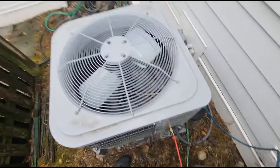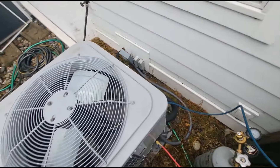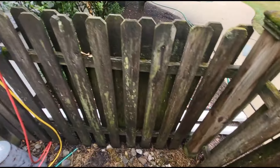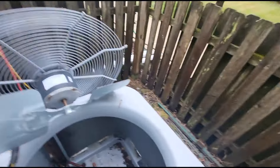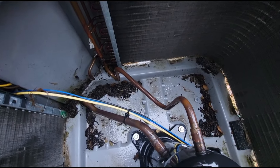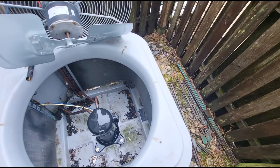I'm going to use my soap bubbles — spray the coil down, spray the joints, spray everything we can see before we go downstairs. It's been about 15 minutes and this unit is still holding at 400 PSI. I just popped the top. I sprayed the discharge line because I know these things are notorious for leaks, but everything out here looks okay. I didn't see any oil stains or any physical signs of leaks.